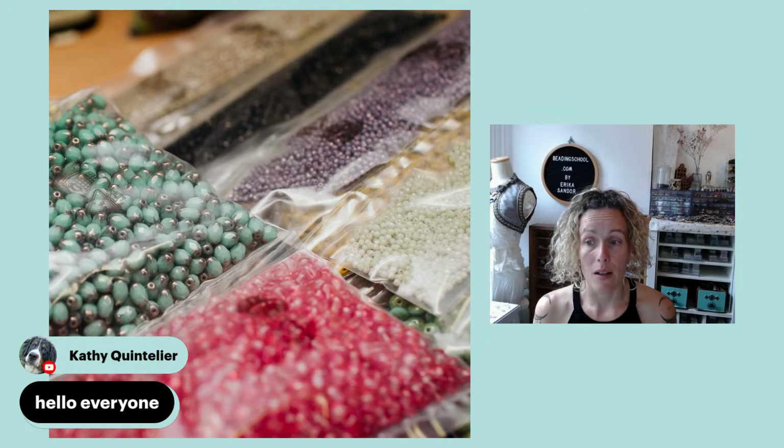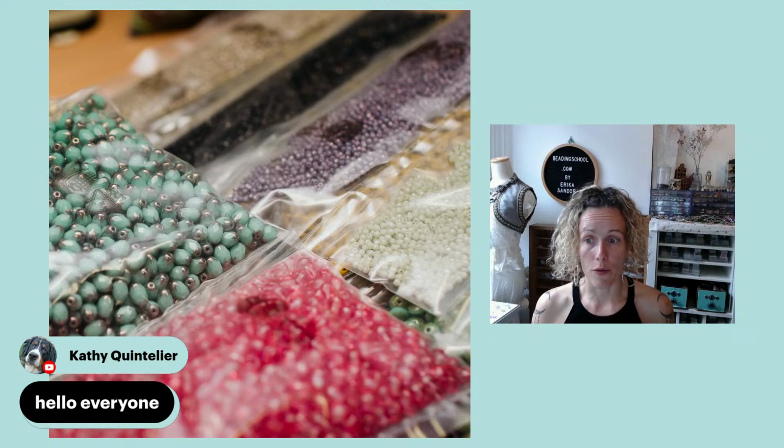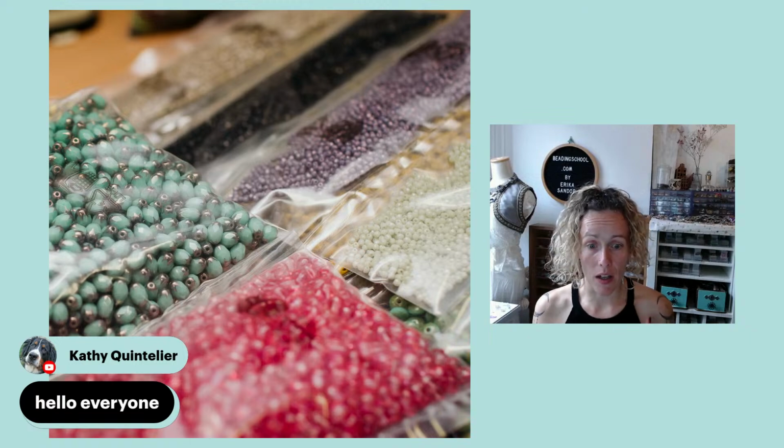The raw materials for glass rods are sand, baking soda, potassium carbonate, and limestone. These are ground and mixed together. Different colors require different extra ingredients to add the pigments, the color to the glass. This can be, for example, manganese for purple, copper for blue, sulfur and graphite for brown and yellow. And an interesting fact, some colors, like pink and fuchsia, contain particles of real gold, and that's why they are so much more expensive.